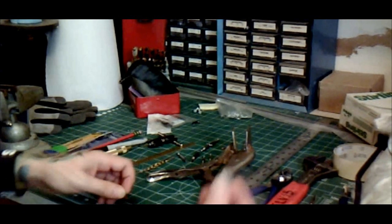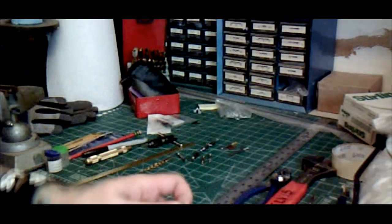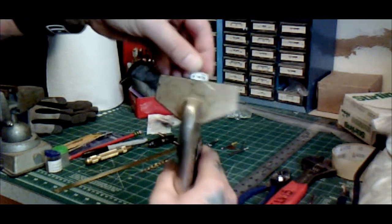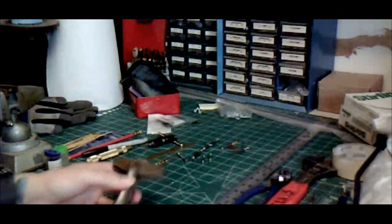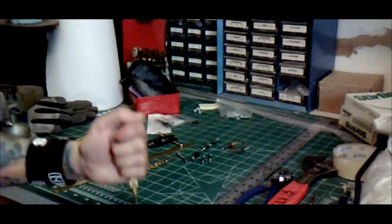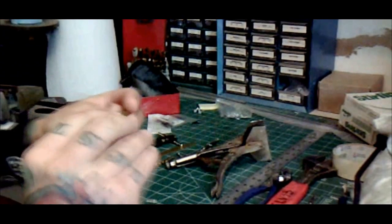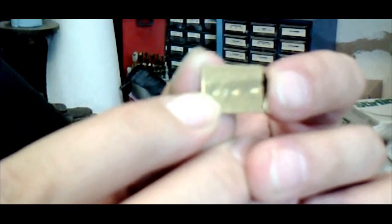I've already made a little punch template. I'm going to lay this punch template with the holes lined up over on top of the brass, use this flat clamp to line it up as good as I can, and clamp that down pretty good. Then we're going to take this punch and just punch each one of these holes. What that does is when we go to drill it, that's going to give us really good little indentations to start from — those little punch holes right there, just for a good start.